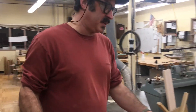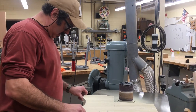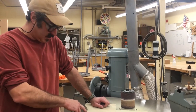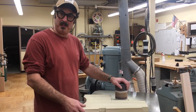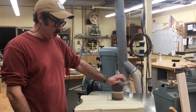I'll take this piece, set it on top of the one that wasn't marked for its radius, and I'll just take a pencil and scribe that line onto it, then cut that one second. It'll be a close enough arc that nobody's going to be able to tell the difference. It's also easier to sand one piece at a time than when they're stacked up, so that's a decision you make — either way is fine.